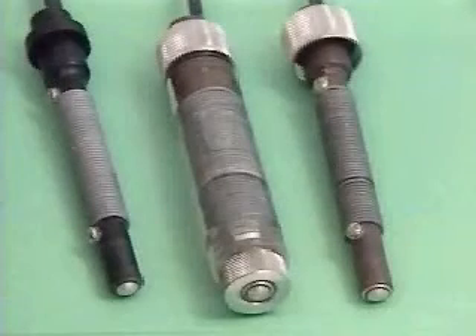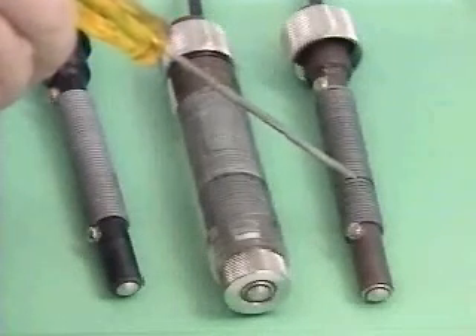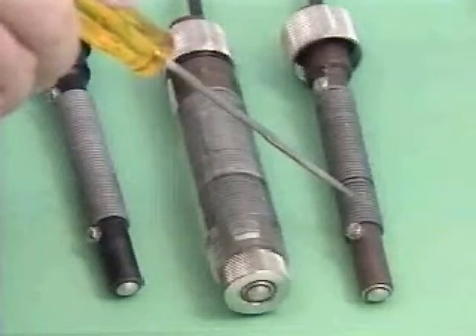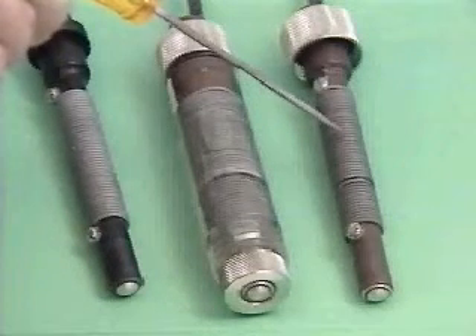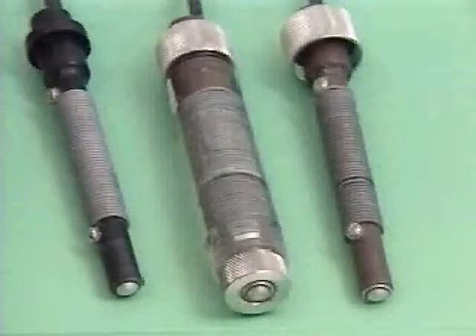There are two lead anodes on the Model 94 sensor. The shorter lead coil is connected internally to the platinum ring and serves to aid reconditioning and response time. The longer lead coil anode actually performs the measurement task. This lead coil is oxidized, and it is this oxidation that will produce the voltage for the analyzer to sense.